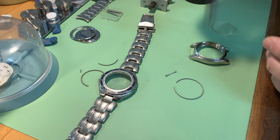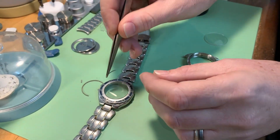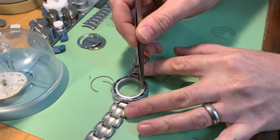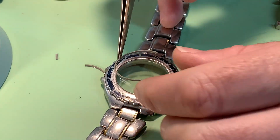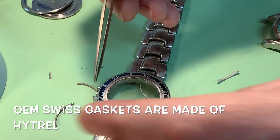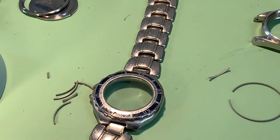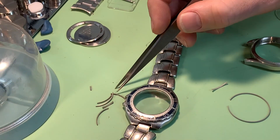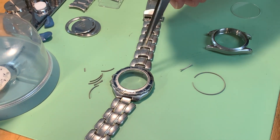This one I've already done — I've made a gasket and fitted the glass. The glass is pushed into this little seal and it sits just under the bezel here. You can't actually see it without removing the glass, but the problem is that it degrades over time and disintegrates, probably as a result of UV light. We have two options: we can either buy a new gasket from the factory, except Omega will no longer sell them except to their authorized service centers.